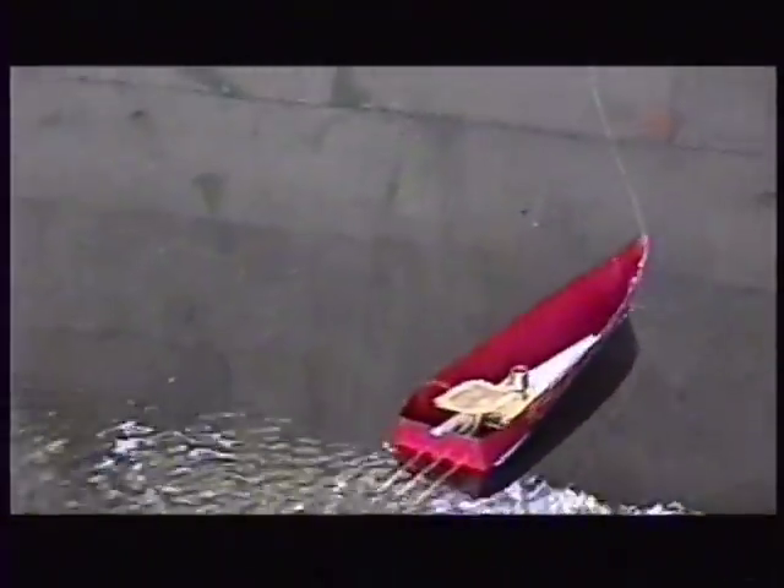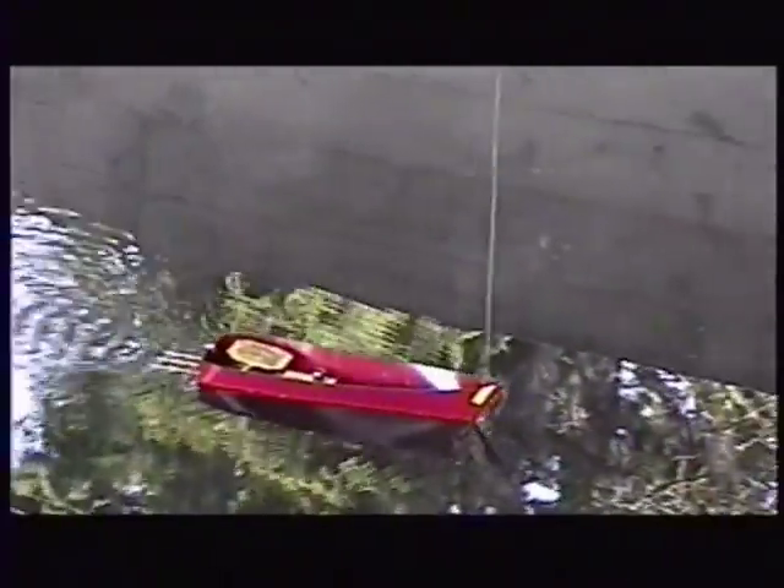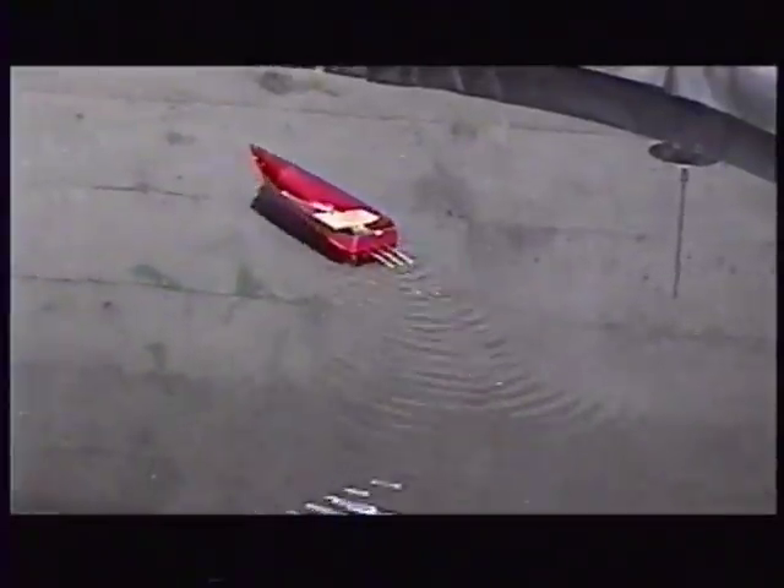The pipes are 1/8 inch ID brass and 5 inches long. One very small wick burning methyl hydrate provides enough heat. It is not very loud because the top is on quite tight and is comparatively heavy material, but I expect it to stretch a bit with use and get louder. It looks like the made-in-India engine, but it is much more powerful and won't rust.